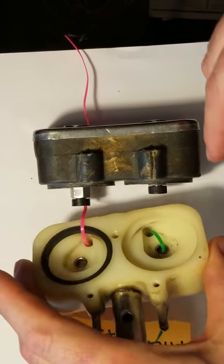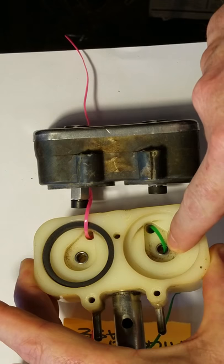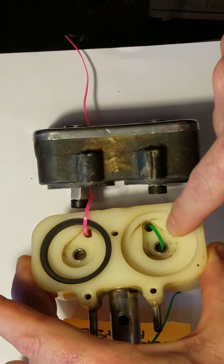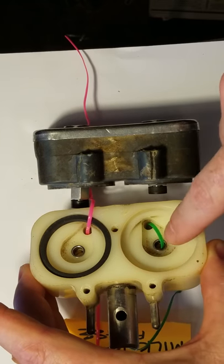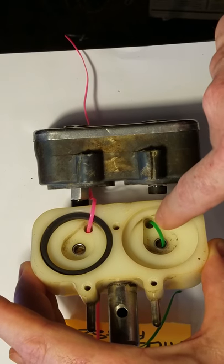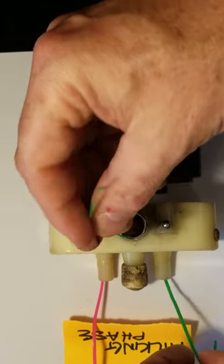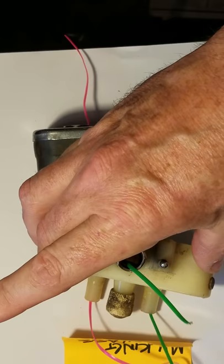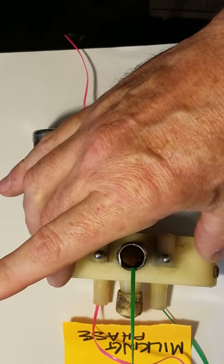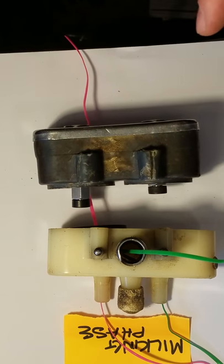With the piston up, we have the connection to the vacuum pulsator line. The vacuum pump is open, so the vacuum is going to come in through this way, up through this hole, and then out to the pulsator line. So we're pulling on that side, letting the other one go out — inside and out. That'll accomplish our milking phase.